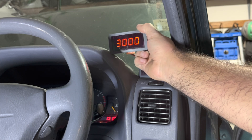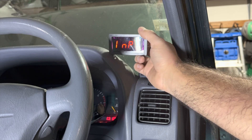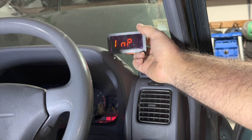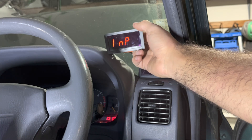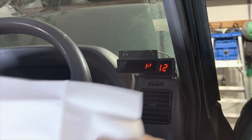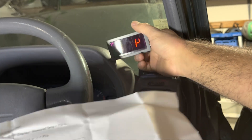3001, and then we'll press Set. So now we're in the menu. LNP is which type of sensor we want — let's make sure it's the correct one. So it's the 4, which means it's the K-type thermocouple. So we'll put in this negative 200 to 1300 Celsius range. Set.